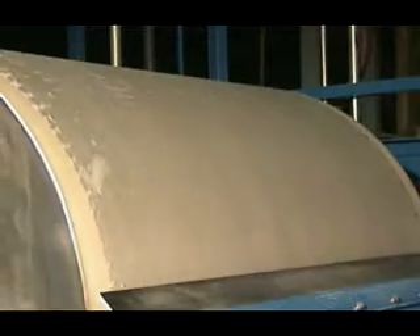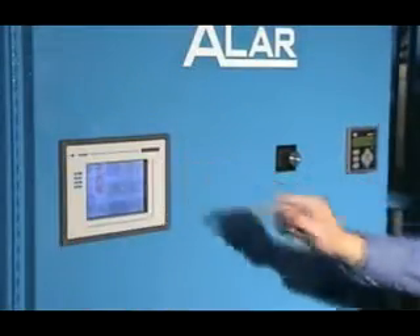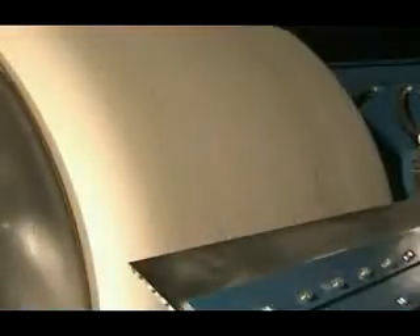After a long day of continuous use, the DE will be exhausted, and the AutoVac is now ready for quick and easy cleanup. Cleanup is performed by activating the water nozzles on the AutoVac spray bar. The cleanup water is minimal and is filtered with the next batch. With the automatic option, the AutoVac can repeat the pre-coat process and go back online, or shut itself down.